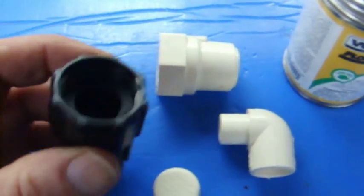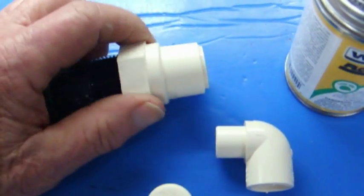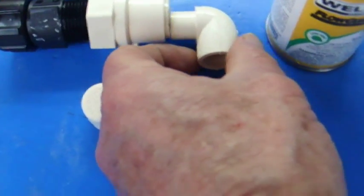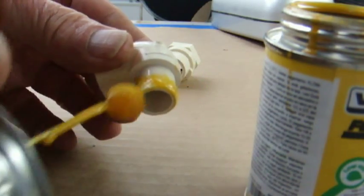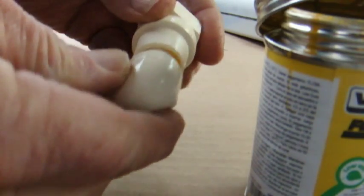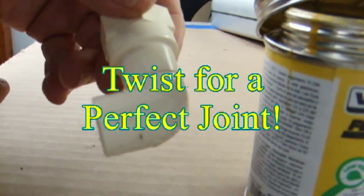Here are the fittings we need to put together that sprayer and rail system. This is a hose connection — we can actually attach a water hose to this, which we will attach the other end to the pump. This will go in this CPVC unit here, and I will actually glue this elbow on there, then put this cap on the other end. To do this you just need a little bit of cement on the fitting, then put it in the receiver and twist it. When you twist it, it makes sure that all that cement is uniform. There you have it — a perfect joint.